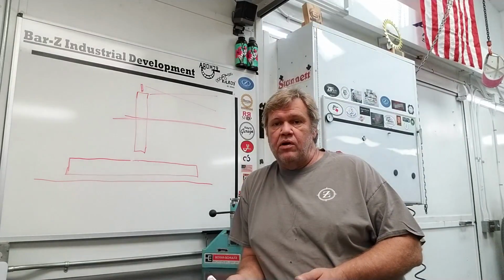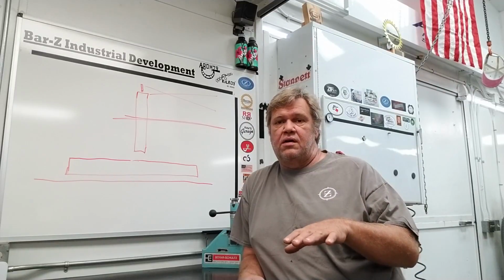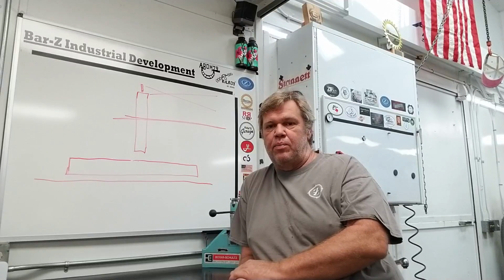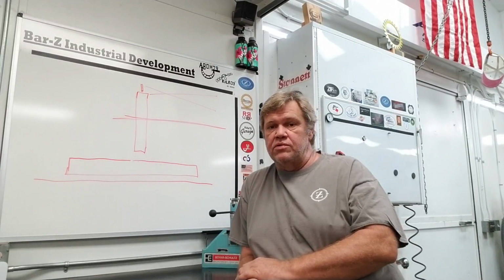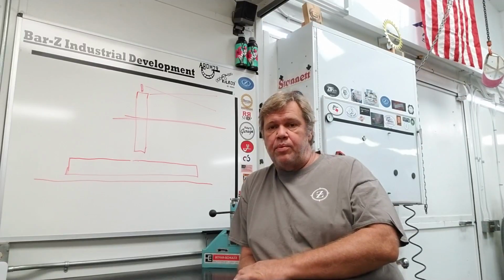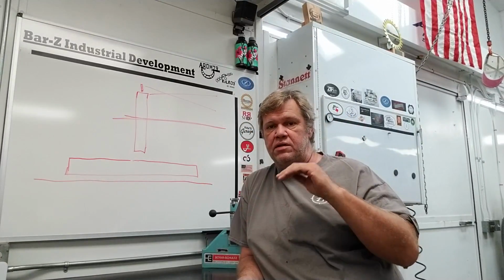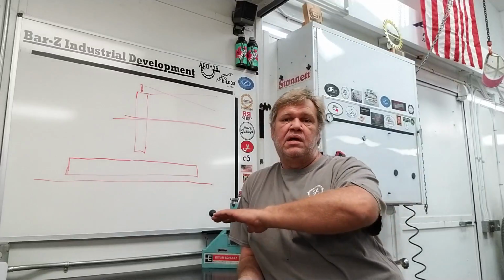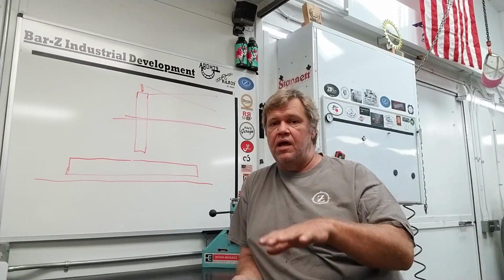Well, if you're doing a lot of flat work and you're in the middle of a project, you can just leave your work. Well, let me tell you what has to happen first. If you're using the conventional method and you're in the middle of a large grind of flat work, and your wheel loads up and your results are going downhill fast, you're not going to make it through the job without redressing. You need to stop, pull the part, drop a diamond on the table, lower the spindle down to the diamond, make your cut, get your wheel all cleaned up and ready to use again. Pull your spindle back up, clean everything up, clean your part, put your part back on the machine, come back down, touch off, and go back to work.